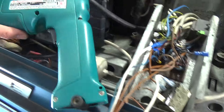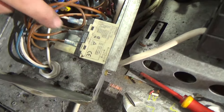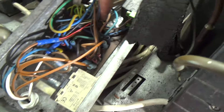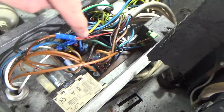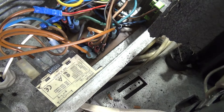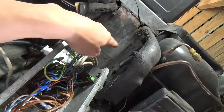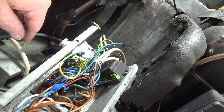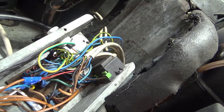Because this thing's so old, I've got my vintage drill out of the van — not sure what year that dates back to, but it's got to be the same sort of vintage. I've got that relay bolted down. I've done away with that broken terminal block and just put a stuffing gland in there so that cable can't pull out. The wires are crimped on to where they were supposed to be going anyway, so we've done away with two joints. I'll get this box put back up and find some screws to screw it to the wall to keep it tidy.